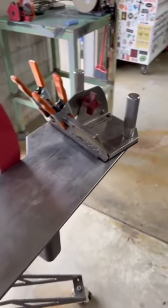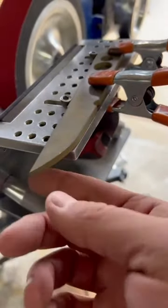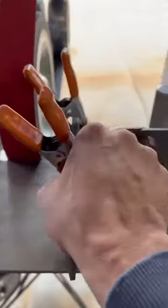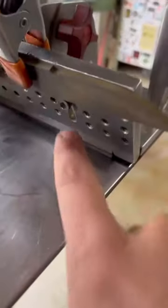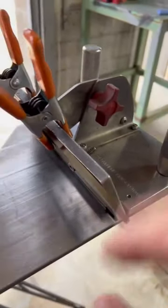The easiest way to grind a modified chisel grind — here it is set up in my jig — is to take the ground edge all the way to the backside, almost zero ground flush to my fresh edge, the edge I will never touch or grind. I'll establish that no matter how steep it is. After that's established, I'll take my jig and back the angle off until I essentially establish a plunge line where I want my final resting point. If you're doing it freehand, which I typically do, it's extremely easy.